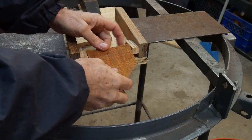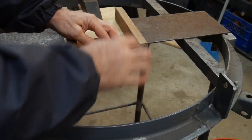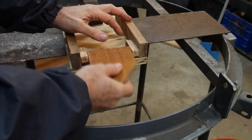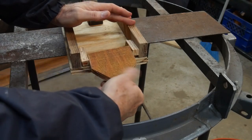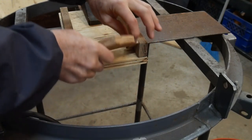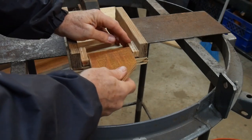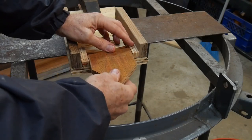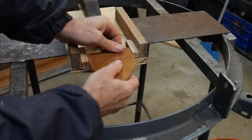As I got thinking about it, I wasn't really sure if they would be able to independently create the rack. Here's the brace that goes across – this represents a small angle. I just grabbed some scrap pieces and nailed them together so I could check the articulation. If you didn't have any control pieces here, the force in the front would just push the whole thing up. If you have them locked in place, you get the nice float – it just doesn't angle. I'd like to have a way for it to automatically angle, but unfortunately due to the forces of the snow, it could cause it to rise up and not press against the snow in one area. So I need to have a way of manually adjusting this rack angle, I'm going to call it.